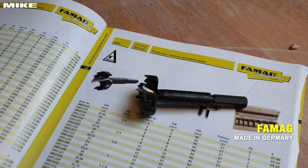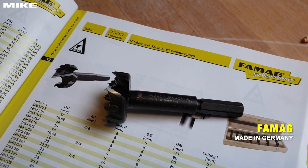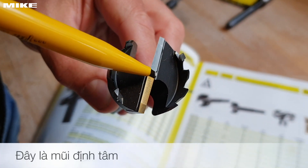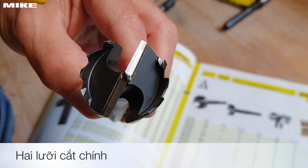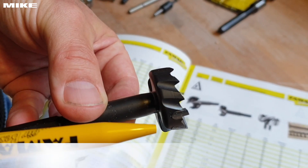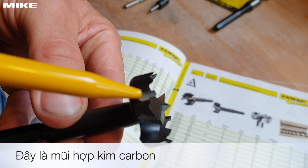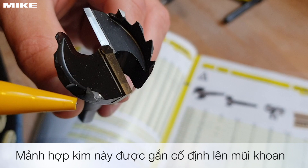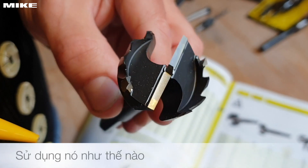What's going on with the Warmax 3? It is a TCT Warmax quality premium bit. You have here a center point, two main cutters, and on the outside you have your cutting edge and lips — it's interrupted. And especially, you find here carbide-tipped teeth inside, so when you make your pre-cut, you make it with carbide.